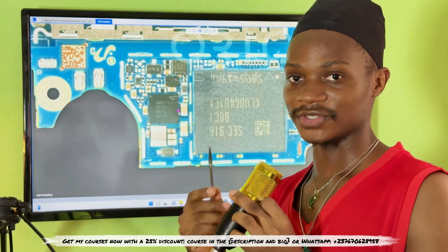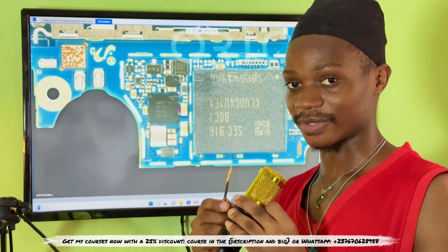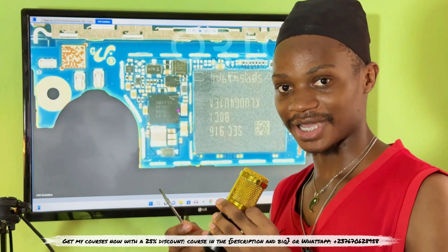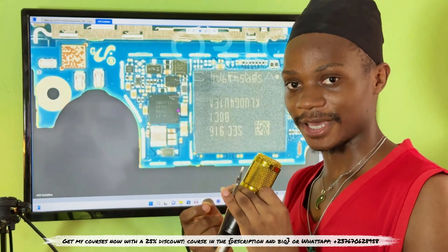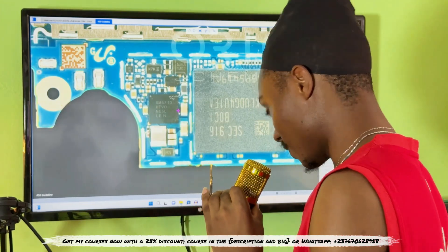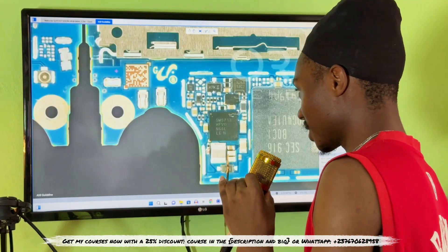The VPH line is always in the charging circuit of the mobile PCB, because the charging IC is the main component that converts the primary line to the secondary line — it converts the V-bat voltage to the VPH voltage through the MOSFET. So why am I talking about the V-bat and VPH? These are the most common lines in a mobile PCB where you can get a short.